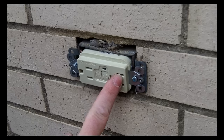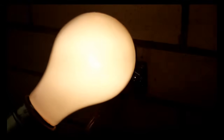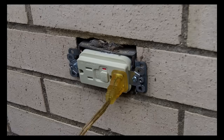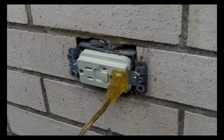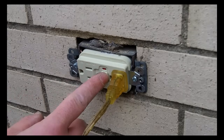If the reset button stays in, plug in a lamp or a radio to see if power is on. In this case, you can see the power to this lamp is on. Now I'm going to test it — I'll hit the test button on the GFCI and the electricity goes off, which means I tripped the GFCI. The little red light here goes on to indicate that the GFCI has been tripped. Pressing the test button should stop the power flow to the lamp or radio, and the GFCI's red trip indicator light should come on.